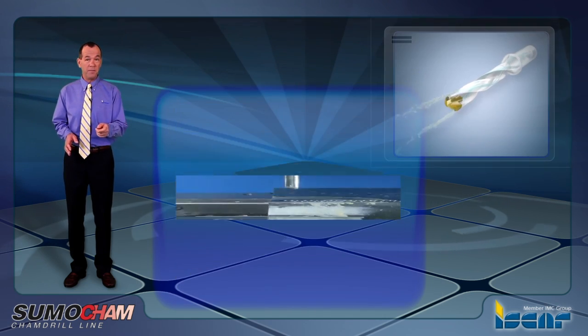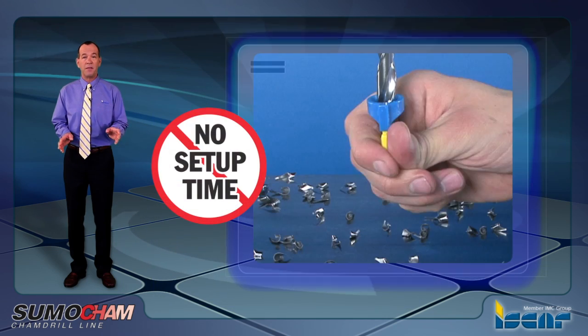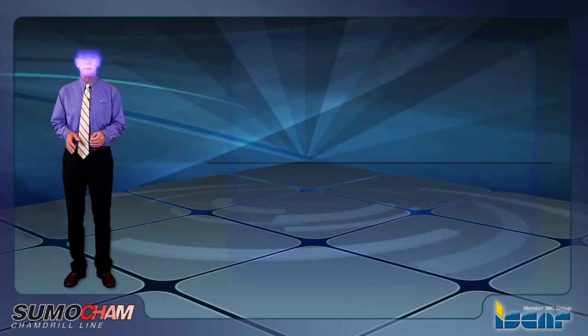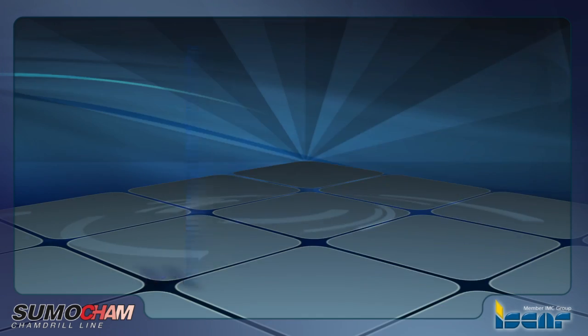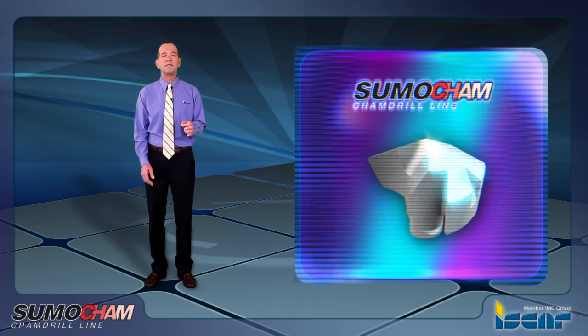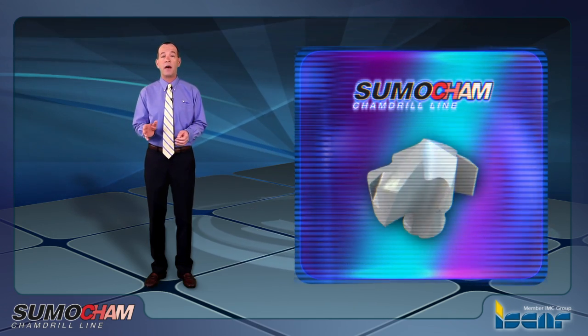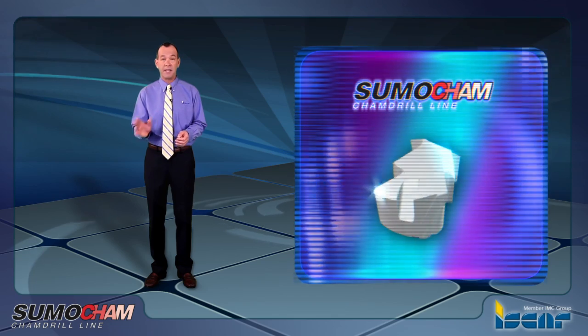What makes this choice better for you? No setup time. This means fast and easy worn head replacement while keeping precise offset. The unique multi-faceted chisel geometry provides a self-centering ability — no pre-centering operation is needed for up to five times D tools, reducing cycle downtime.